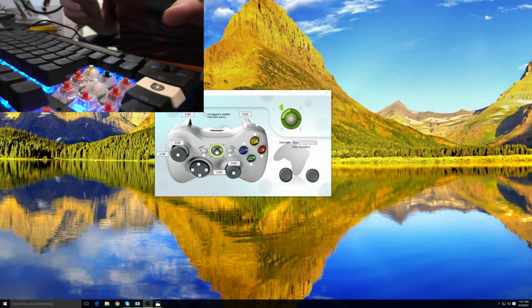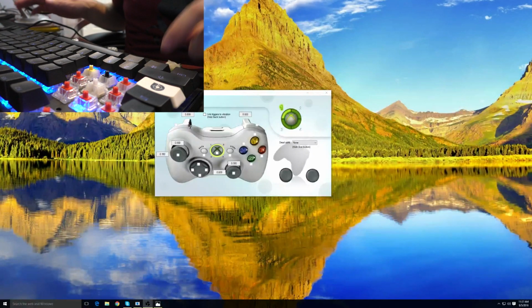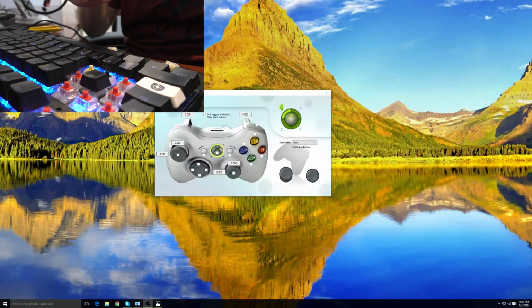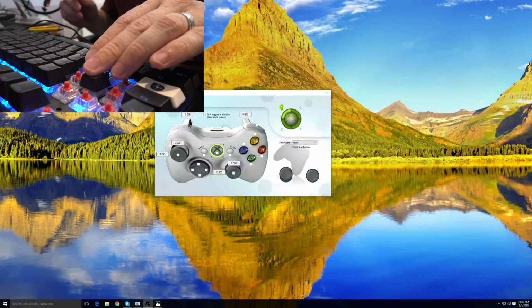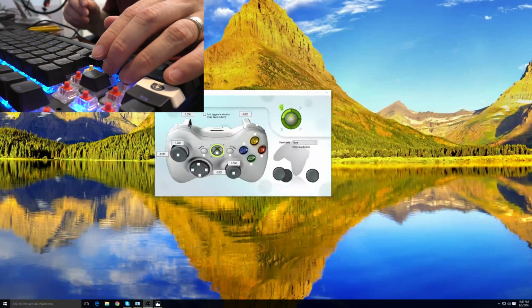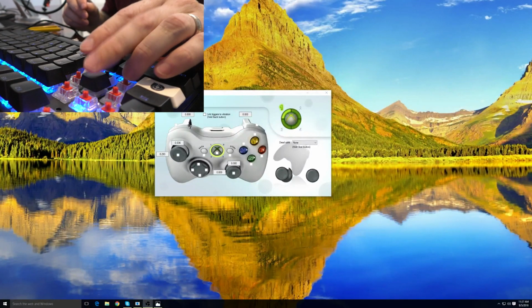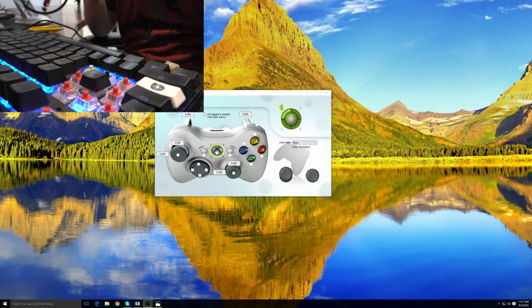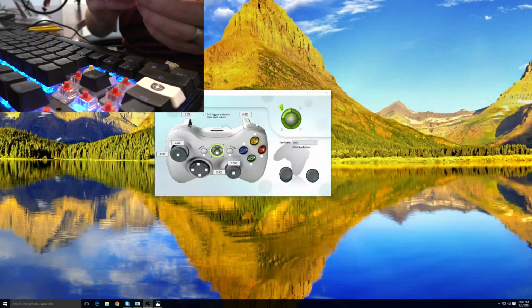So these are all from different manufacturers and different qualities, but again I have to do the same process, and I have to stick these keycaps on to get a new calibrated value, because if I just use these ones by themselves, you can see on the screen I'm getting some weird things. It's not centered, and I'm not getting a nice smooth response. It's not taking the full read basically, so I do need to recalibrate them.